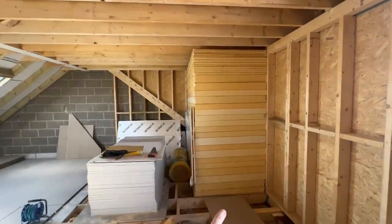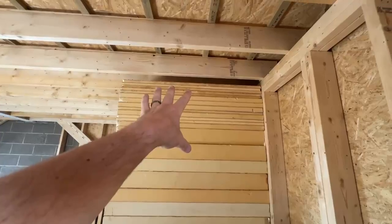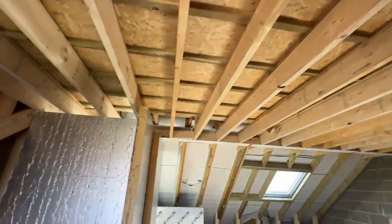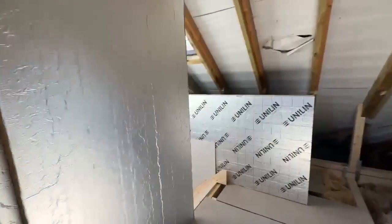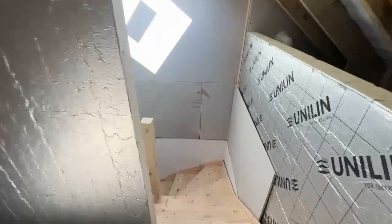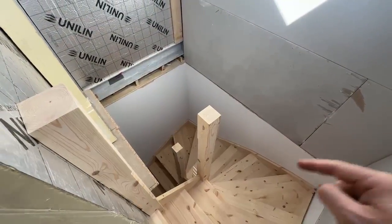Like I say, we've got all the different sizes of insulation as well. So we've got the 90, the 120, the 50 and the 25 overlays and stuff like that as well. On this one, we've got a cold roof setup, so we've got the cross ventilation as well, so it is all ready to go for the client. Obviously last night was a bit of a cold snap, so what they've done is they're trying to make like a surround around it, just to try and keep a bit of separation around these stairs. Now, the stairs, part 2, the reason you are here.